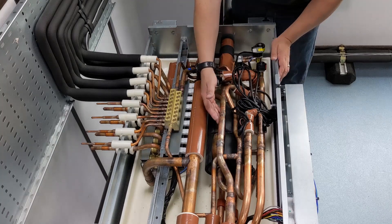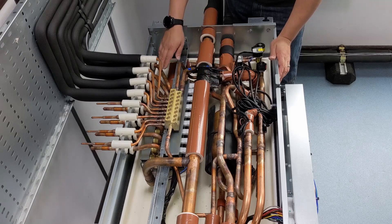So I'm going to draw off my five kilowatts of vapor off the top of that gas-liquid separator. I open up this port here and send that refrigerant through the indoor unit.